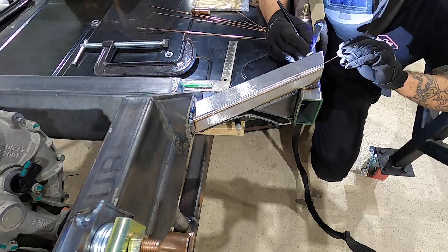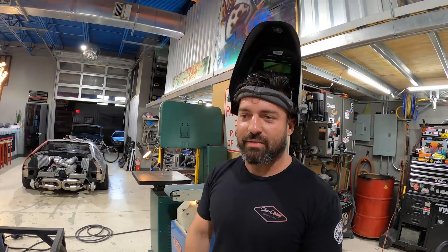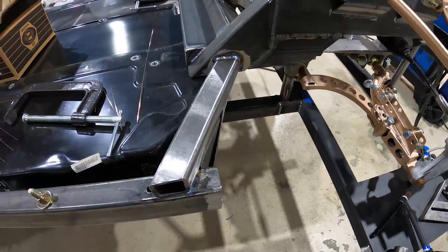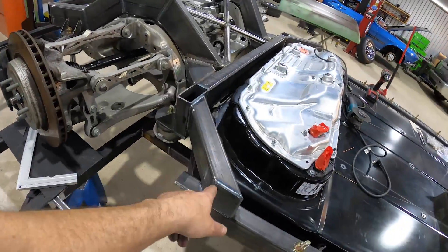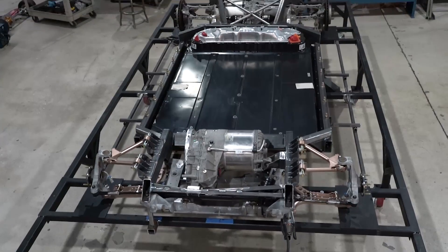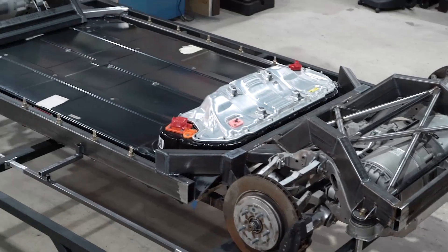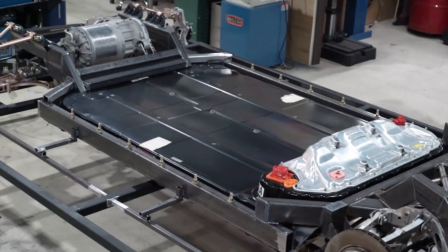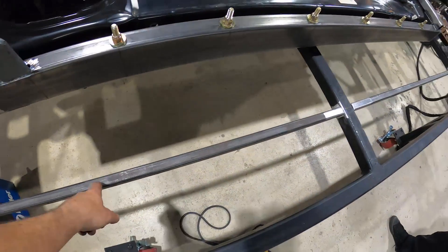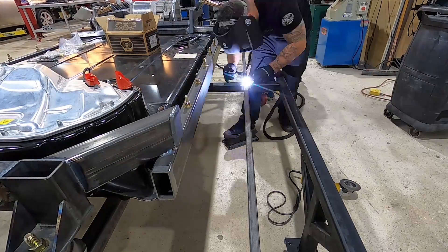Donnie's been welding away. There are just a couple spots to finish once the battery tray is down and out, but structurally everything is there. We have our front subframe with gussets in place and our rear situated — more gussets are going in back there too. The foundation of our chassis is done. Before going further, we're going to hang the cab — get everything set with the truck body itself before tearing it apart to continue welding. We'll weld the one by ones in the chassis table and add more fixturing to hang the cab and get it leveled and square.